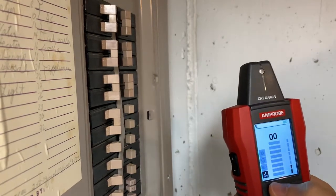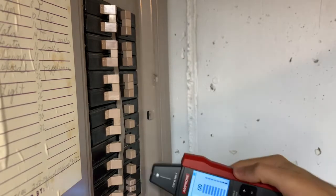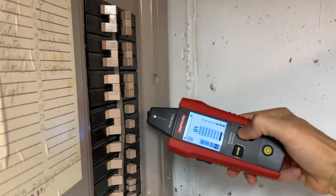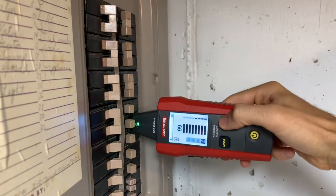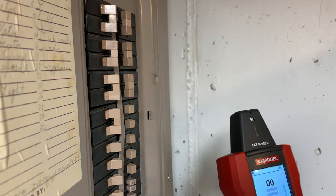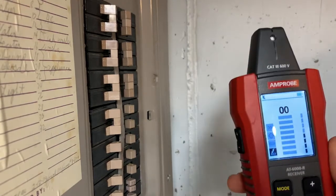The last mode is a non-contact voltage mode — that's just saying you've got voltage. If I increase the sensitivity, we can say, oh yeah, this is an energized circuit. So it's just like a volt pen that you'd have in your pocket.